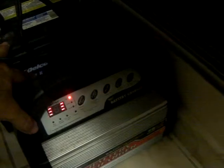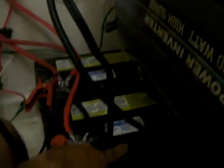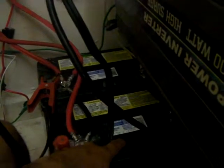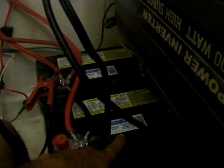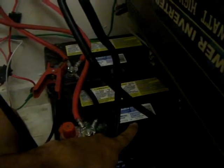Now my batteries — I'm giving them a desulfating cycle. I do this every month for two days, then charge them. Now that the batteries don't need to feed my chargers or be charged from the solar panels, these two batteries get all the energy from the solar panels. I only charge and maintain the backup batteries once in a while since I'm not using them — I just use them for blackouts and emergencies.